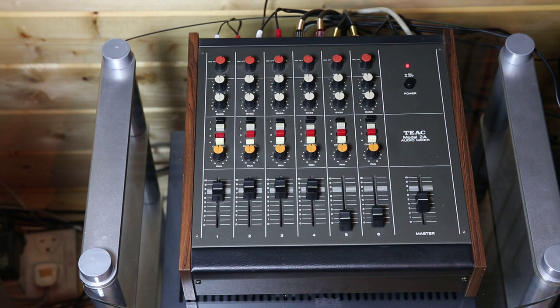There's also a direct cue out for each of the input channels, which isn't affected by the position of the faders or by the equalizer — you always get the output there. Each of the four output channels also has a bus in line socket so you can stack mixes together and have a single master fader control both mixes. Each of the four outputs also has an aux out as well as a line out, so you can send audio to two different locations. I think that's about it, thank you very much.